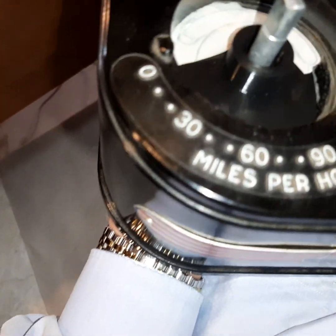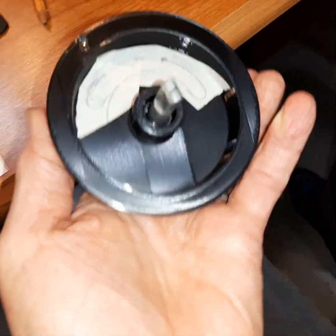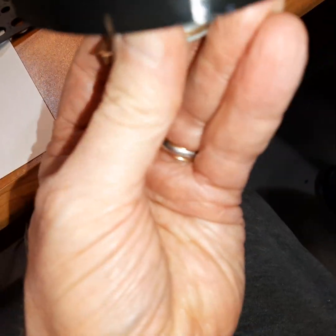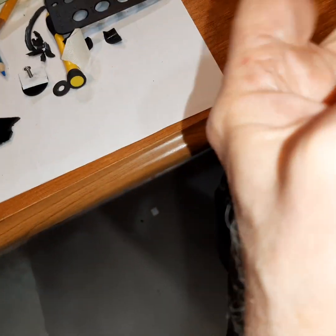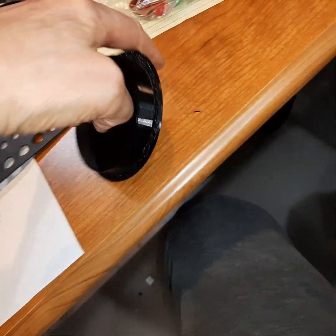Very pleased with the fit so far. I put in just a little bit of clearance and it seems to be really snug, really nice. The other thing that I like was how this shaft fits - that was a measured dimension. I added just maybe 0.5 millimeters or less, and it's just a really snug fit. There's hardly any slop. It fits tighter than the factory one, by the way.